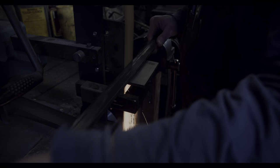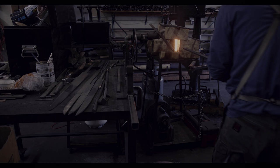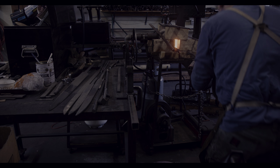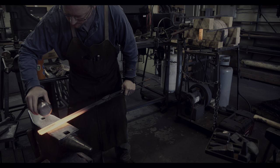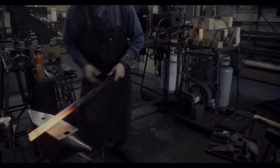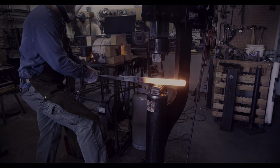Given all my recent failures, I decided to forge weld a test piece first. I took 4 square bars, cleaned them up on the belt sander, and am now trying to weld them together in the forge. This is good preparation for the final welding step of the sax — it allows me to test the atmosphere in my forge and also the squareness of my bars. As usual, I protect the welds by applying anhydrous borax as a flux. The borax is liquid at welding temperatures and creates a glassy coat around all the bars to keep the oxygen away.